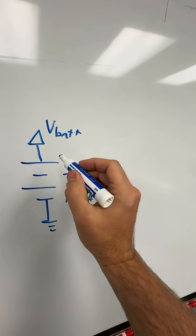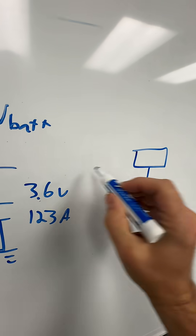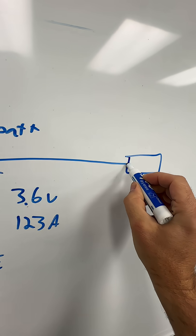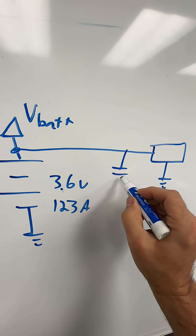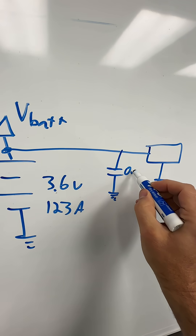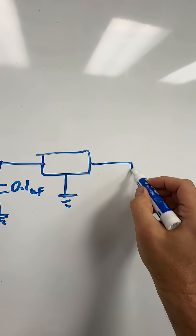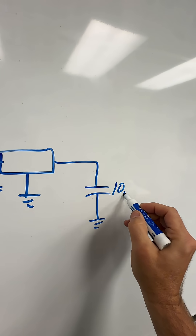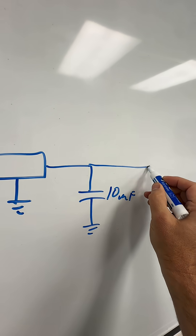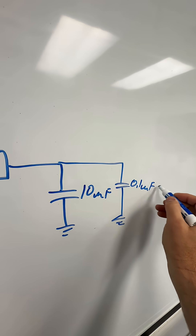There's a little bit of style that comes in here. Let's say you want to run this over to a linear regulator, which is also connected to ground, and you want to explicitly show that with a wire on the schematic. Then you can have a capacitor here that also goes to ground — maybe that's like a 0.1 microfarad bypass. Come out here and you have an output capacitor, let's say 10 microfarads, and maybe bypass it too with a 0.1 microfarad cap.